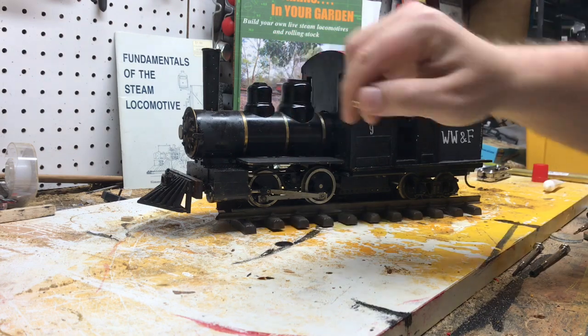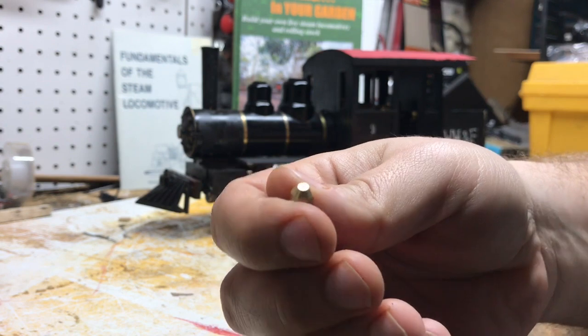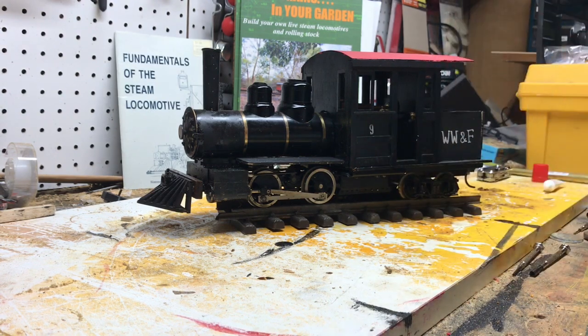So I was having trouble all the time. I ordered a new jet for the burner, and I installed it the way it said to install it. And as you saw in my previous videos, it would kind of run, but not run well, and then the fire would go out, and it just wasn't building any pressure or any steam. And I sat here and I wondered, and I said, geez, it's all the way up against its stock fittings, it's where it should be.